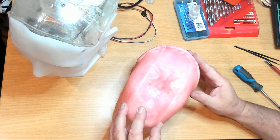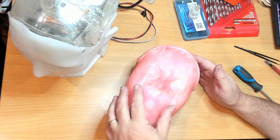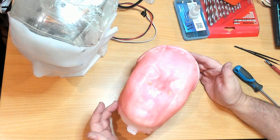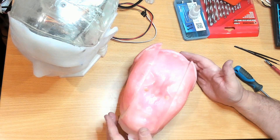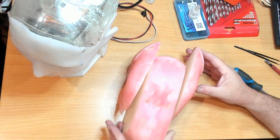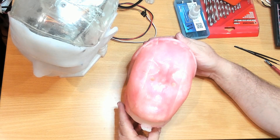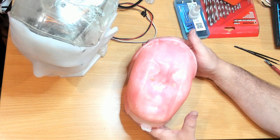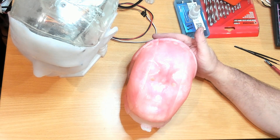This is actually near enough to pre-version one — one of the very early prototypes — so I could start playing around with it. It was a while before I printed it, and I discovered that this particular version didn't have the jaw magnets provisioned in it. When I print the new one out — because I damaged this one, I broke the top tab off as you may remember from my previous video — having a clear acrylic coat to separate the resin from the silicon will also give me better curing. So these are things that I've learnt.